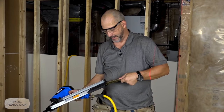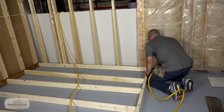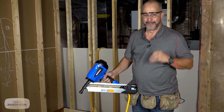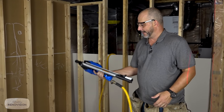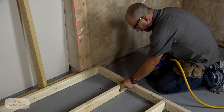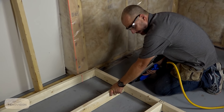Now, if you're gonna be framing your basement, you might wanna pick up a gun something like this. Framing nailer, there's a 3 1/4 inch nails. This one's at 34 degrees, it's very common. Most of the guns are the same angle. The idea is it sets the nail in straight and keeps all the hardware away from where you're working. With a gun like this, this is one time where I definitely agree with all the trolls, wear your safety glasses.